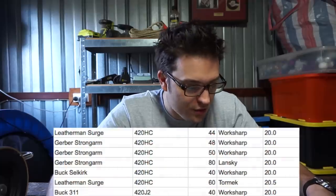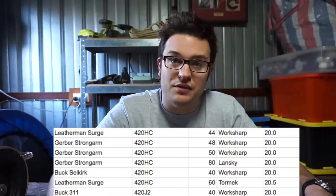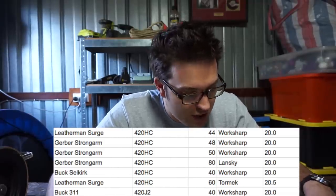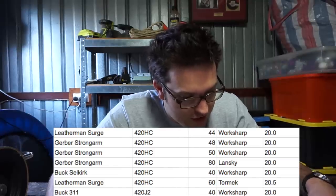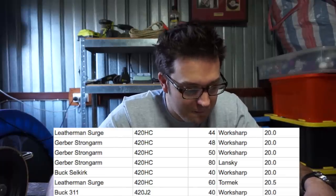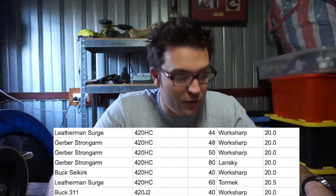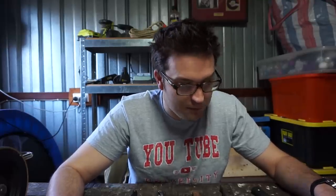420HC. All sorts of testing with that one, and I have noticed a pretty decent curve towards Paul Bos's treatment being better. So with the Worksharp, Paul Bos treated 420HC got to 67 cuts, compared to what is usually about 44, 48, 50 from brands like Gerber and whatnot. And it was all the plainer when I used Buck's other 420HC, the stuff that is not from Paul Bos and their Chinese knives, cut through the rope 40 times with a Worksharp edge.